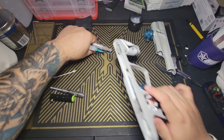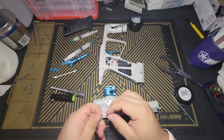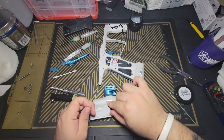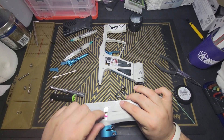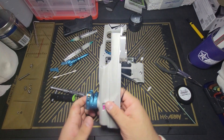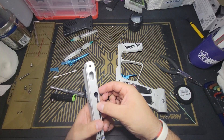We're going to put everything back on the top body — go ahead and put the detents back in. We'll wait to put the eye covers back on because if they don't go back on quite right when we torque this down, we're going to have some problems with the top body not wanting to go back together right. Now we get the fun task of putting the frame back together. When my Torque came in it had a piece of black tape holding the eye wires in place, but since this marker is three or four years old, the tape had lost all its adhesive property.